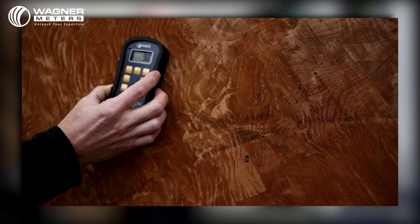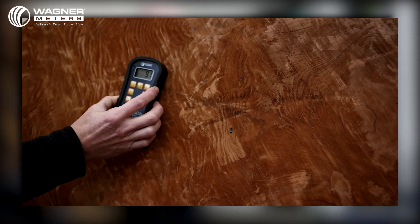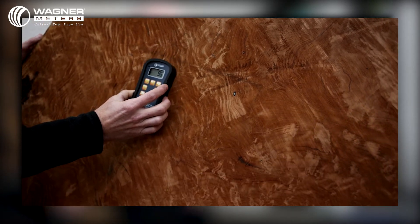If you have big jobs or big stacks of lumber, or if you want to get readings from an entire tree and have them all localized in one file, that's a really cool feature. I only woodwork in Oregon, so I generally know what the equilibrium moisture is, but it's a pretty cool feature to be able to tell what something needs to be dried to in your living room versus your shop versus wherever. It stays pretty consistent for me, but I think the equilibrium moisture content reading Wagner added — to tell the moisture in your shop versus your living room — is a great feature.